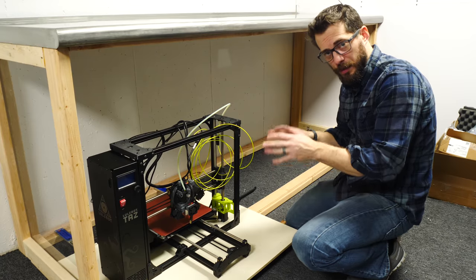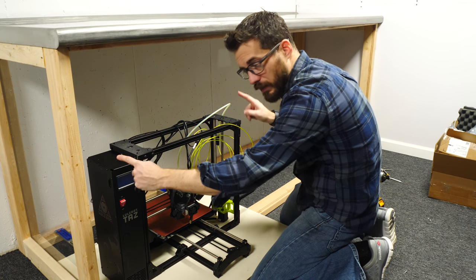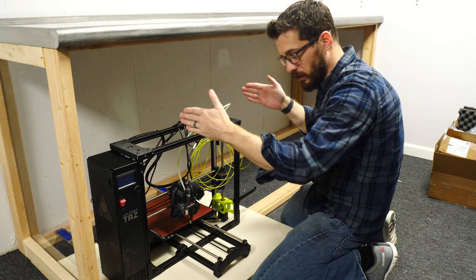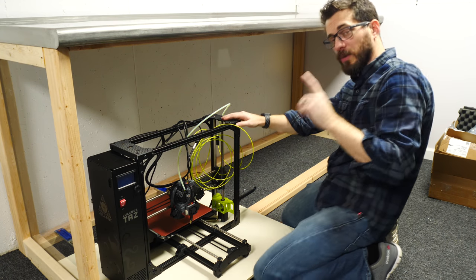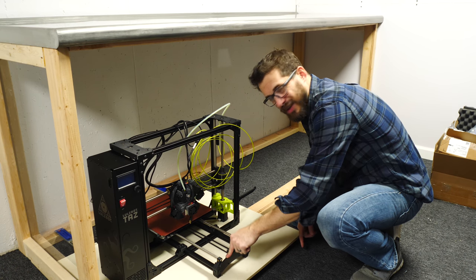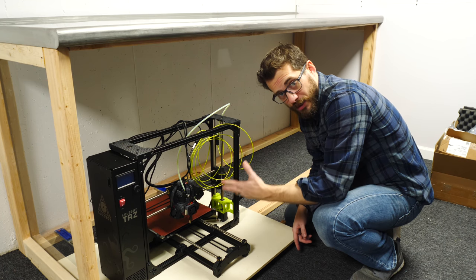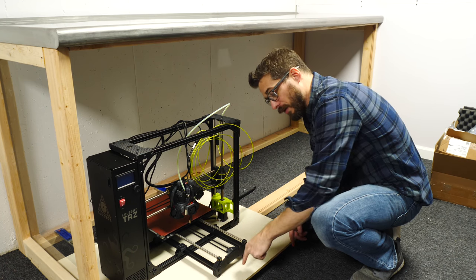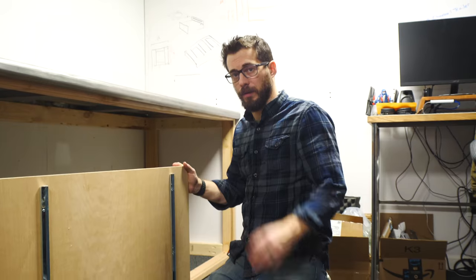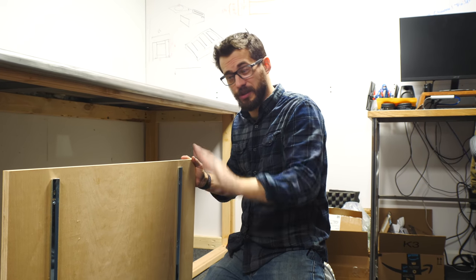This is the biggest printer I want to put down here, and to make sure it could slide fully, I put the slides underneath where the feet of the printer meet the wood so all the weight transfers right down onto the slides. But we found that by using half-inch material, there was some bow and the feet in the middle of the printer didn't actually touch — that means the printer would wobble while printing. So we pulled out the half-inch material and replaced it with three-quarter inch. I put the rails on in the exact same spot so it just dropped right in.